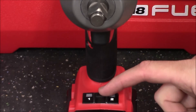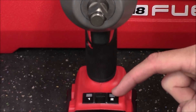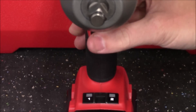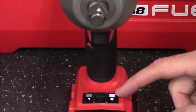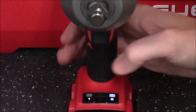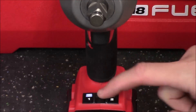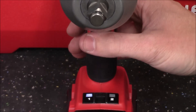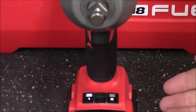There are two different speed or power modes and you'll change those at the base of the grip. There's a button in between number one and number two with a corresponding LED that will light up. If you don't see an LED on either side, it means you cannot switch between the modes — you'll first need to press in on the trigger. We're in speed or power mode two, which is going to be the high torque mode. When I press in on the variable speed trigger, you'll hear it move very quickly and it's putting out maximum torque. But if you want to run some lug nuts down, that's not a safe mode to use because you could easily strip them out. Switching over to speed or power mode one is going to be a very low RPM and low torque mode, much safer for smaller fasteners or just snugging something up.